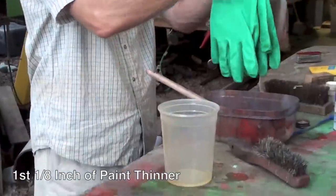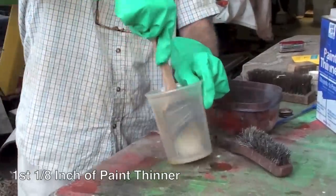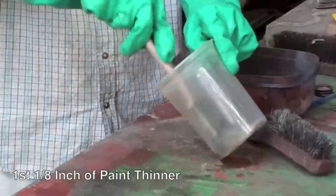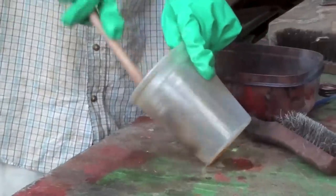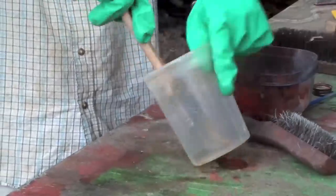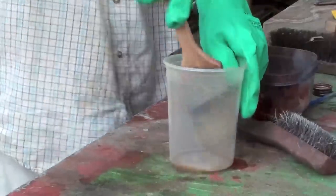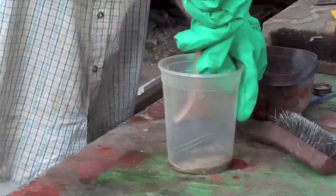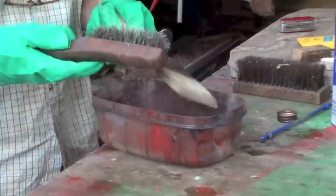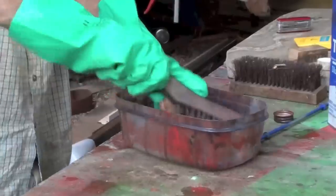I'm going to put my gloves on. What I want to do here is get the brush down in here and really get it up into the ferrule and make sure I break that bond. I'll clean my work pot a little bit, and each time I do it, it's going to be cleaner and cleaner. I want to get it in here, bend those bristles back, and really let that thinner get in there and break that finish bond. Then I'll stick it in my pot where I won't spill anything.